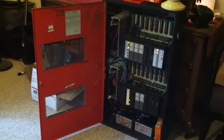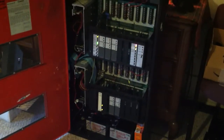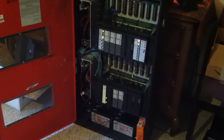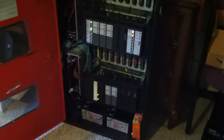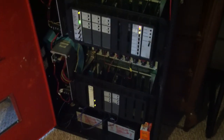The somewhat unfortunate thing is that, like a lot of these systems from this time period, it requires an EEPROM to program, which you had to use a burner connected to the DeltaNet CAE configuration software — which I don't have any of. So I can't really program some of the advanced functions on this panel, but that's kind of okay because it's a conventional system. It's pretty easy to clear the troubles on; I just need to figure out some of the wiring.